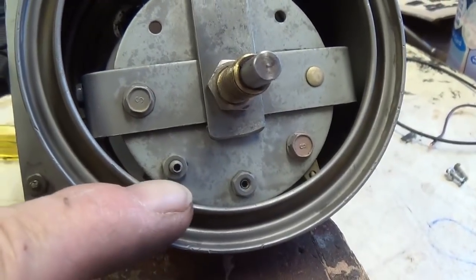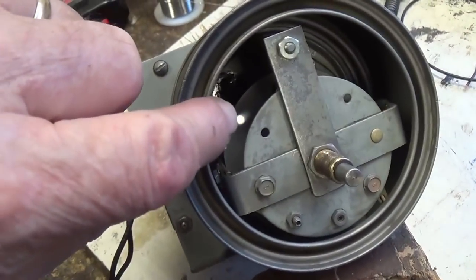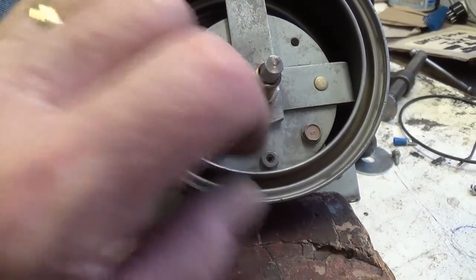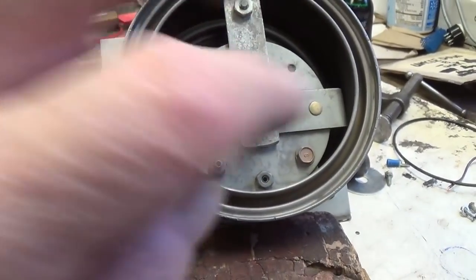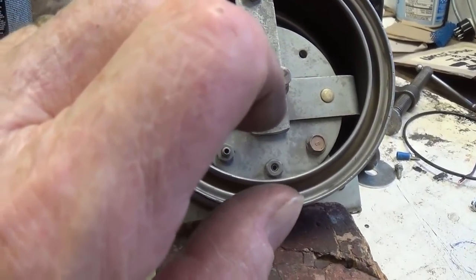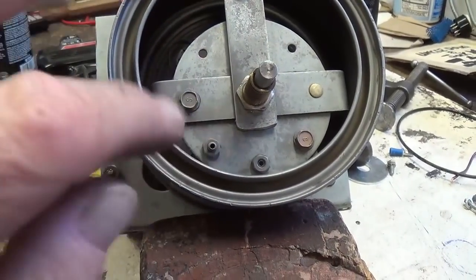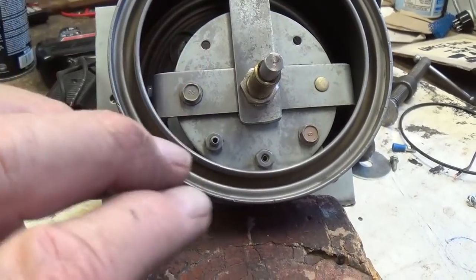You only put in a very tiny amount. Now, if you notice, the whole mechanism is off center in the can, so that the anodized disc passes probably within about an eighth or 3/16 of an inch from the bottom of the can. So you only want just a small amount in there so that the rim of the disc will pick it up, and then the oil will pass over the surface, be spread by that really wide, heavy rubber head, and will provide the type of memory storage on the surface of the disc that's necessary then for us to write and then read our musical signal.